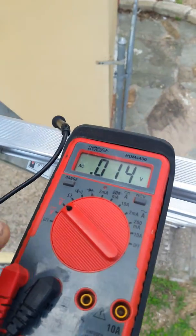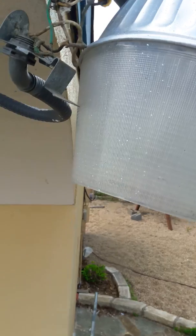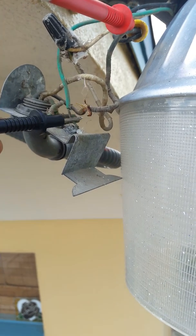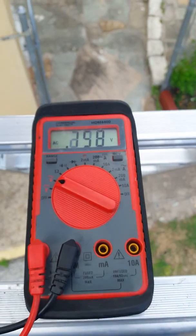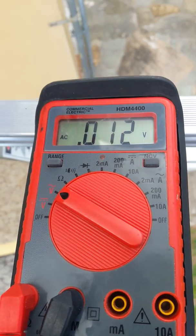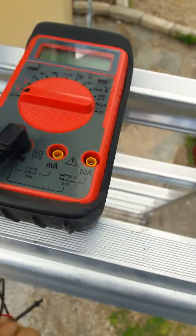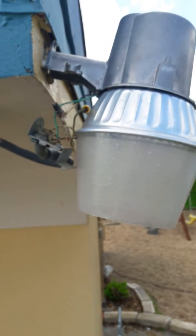We're back up here with our handy-dandy voltmeter. We're going to plug into the yellow - nice and tight - and then touch the green, the ground, or you can touch the metal because it's grounded to the metal. As you can see there is no voltage - none whatsoever. It's reading 0.012 volts, which is just residual voltage and you're not going to be harmed from that. Whenever we get this down I'll show you how to ohm it out and everything else.